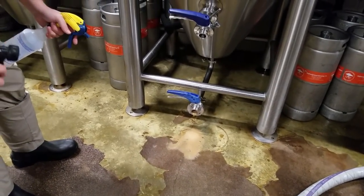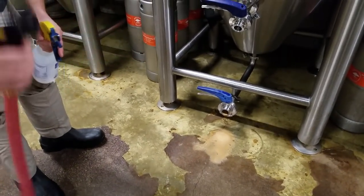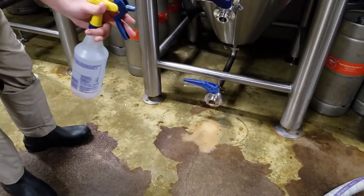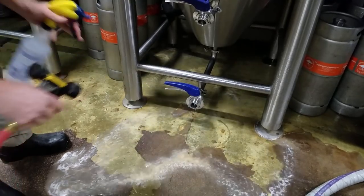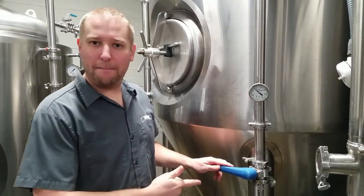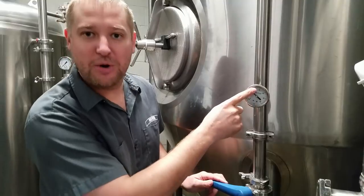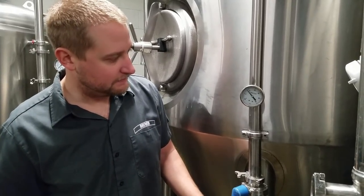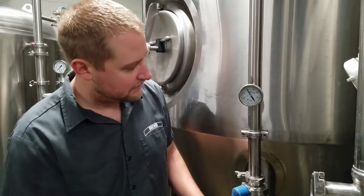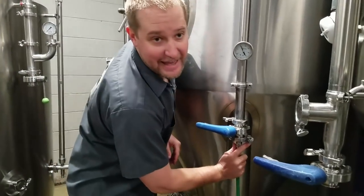After you've dropped and blown your cone, disconnect all the parts from the bottom blowout butterfly valve. Hit it with water to clean that spot up, then hit the bottom blowout with some isopropyl again, and leave it like that till next time. Now bump the tank pressure back up. After dropping the cone, it went down from 10 to around 8 psi, so bump it back up to 10. Then disconnect the gas and take off the bottom gas quick connect.